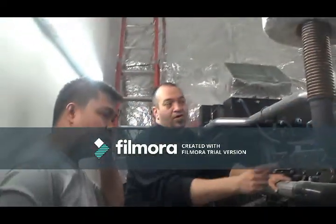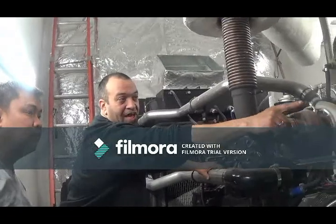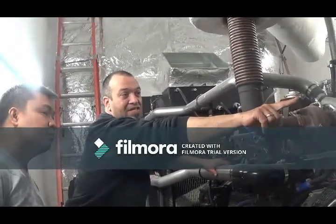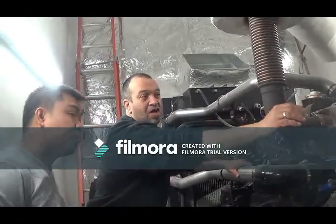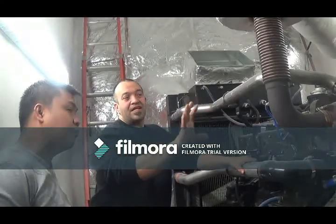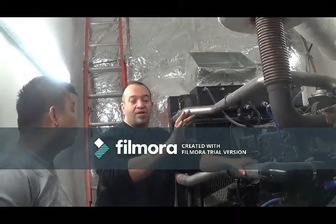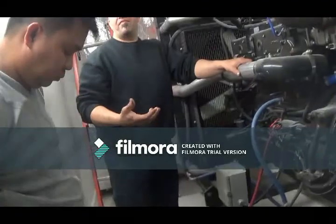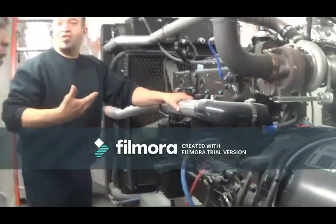Okay. So the one on the left is your voltage gauge, right? And the one on the right, that's your DC ampere gauge. That will not always work. Sometimes you'll see 2-3 amps. That's telling you that the batteries are being charged. Obviously, your battery voltage needs to drop enough before the charger will charge. You don't want to charge it at all times.